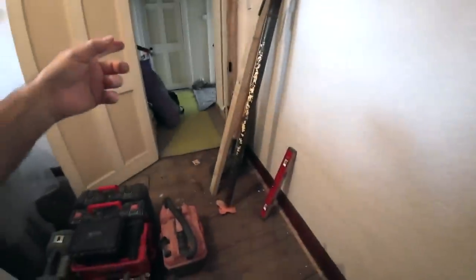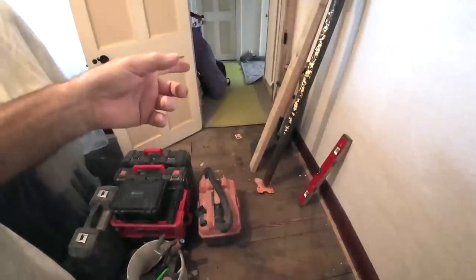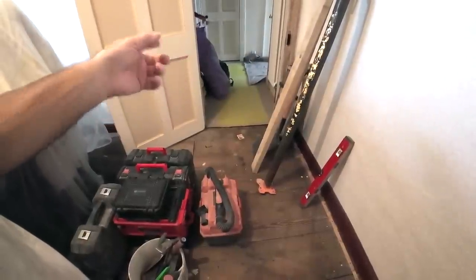We're going to put a 4x2 down on either this side or the other. A couple of strong boys up there instead of doing the ceiling. Lintels downstairs. We picked up a 1200 and then took it out and put a 1500 in because this doorway is going to be 940, so we can cut the 1500 down.